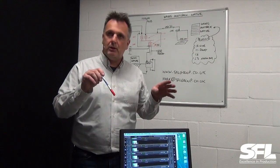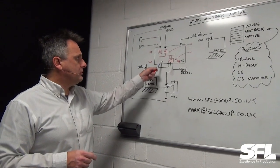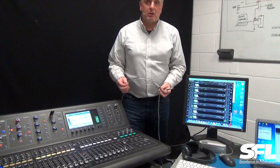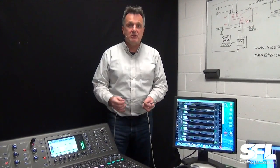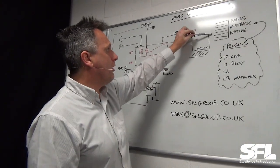We're going to make sure that our critical outboard effects stay consistent. The way this has been set up, we've got a Midas M32 simply connected to the Mac Mini that's running Multi-Rack using a USB cable. This desk comes with a standard 32-channel USB sound interface, allowing 32 channels one way and 32 channels back. This is effectively our effects loom to patch in a load of effects, and I've set up a Waves Multi-Rack environment on the Mac Mini.